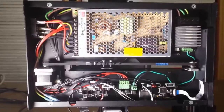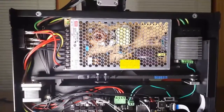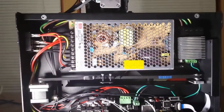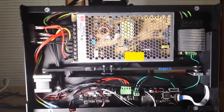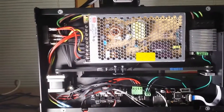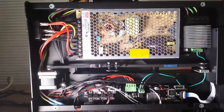That should resolve the issues with the hotbed, assuming it's wired correctly. I'm aware that I have green, yellow, and brown wires and a black being used for this — electricity doesn't care what the color is, as long as it goes from the positive of the power supply to the positive of the MOSFET controller, and so on.